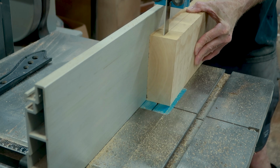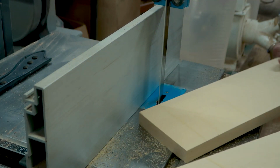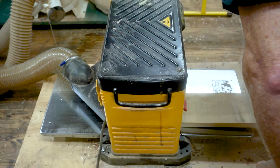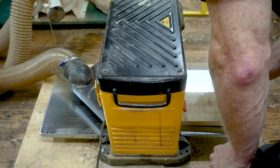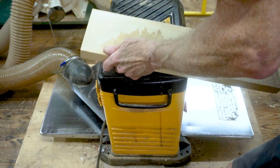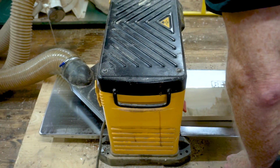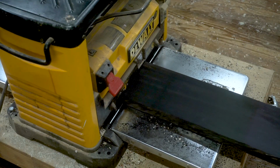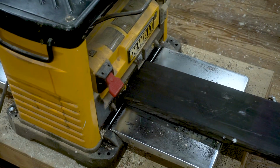This is a folding travel board, so I'm not able to use a plywood substrate because it would be visible when the board is folded. So that's why it will be solid wood all the way through. I'll plane them to be about 7/8 of an inch thick so that I have enough material left for sanding after all the glue ups.